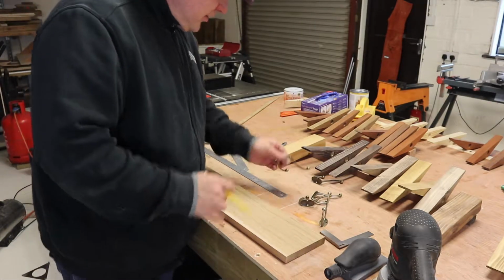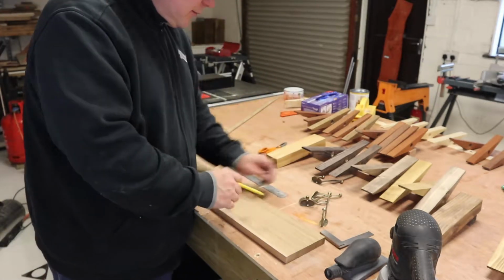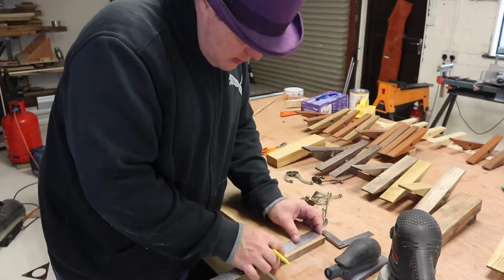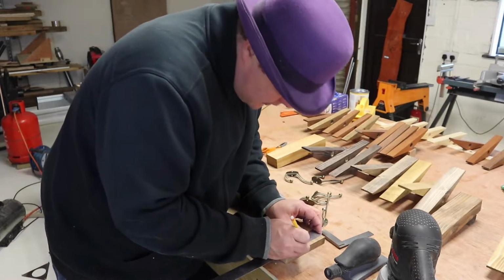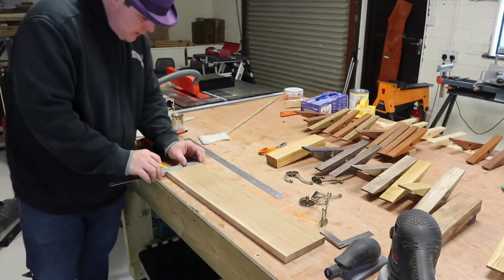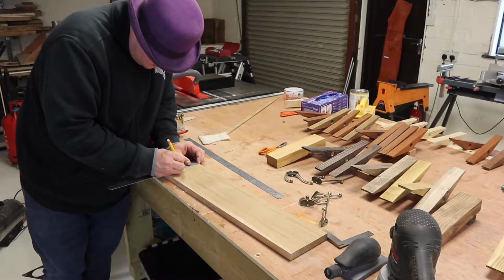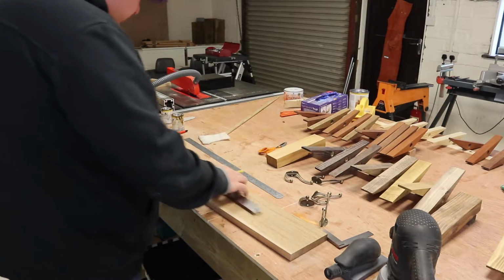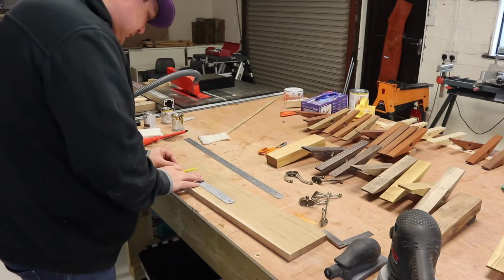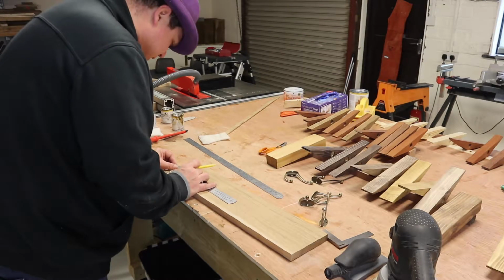So that is our centre line. As the holes for these screws are in the middle, we know we can put those in the middle there. So, next step, we need to mark the middle of this, which is 130, so that's 65. So let's just put a little mark at 65. Another mark at 65. And then we want to decide how far in we want the holes to screw this into the wall. So 30 is too much, maybe 20. So yeah, let's go 20.